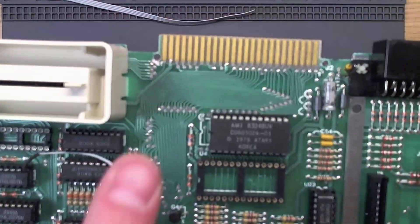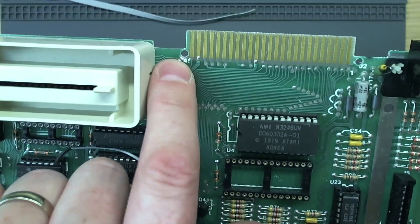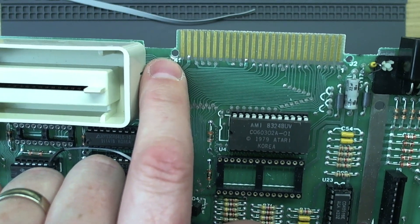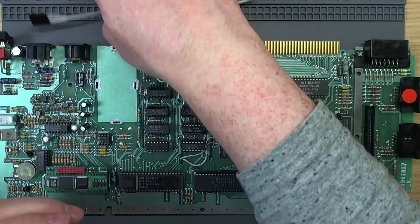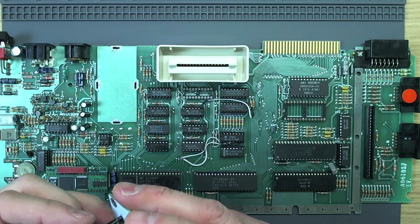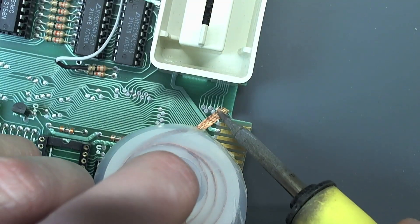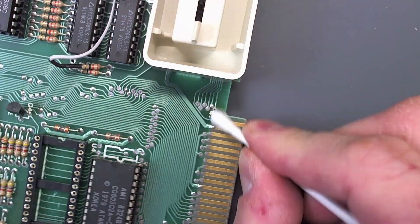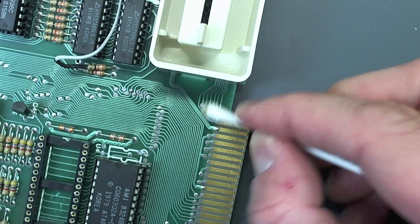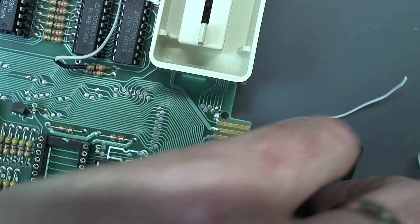I drilled two holes in the board here for the Ultimate — I got a little bit close to this via here, so I just had to scrape that away so that it doesn't touch the shaft of the screw when it goes in. I scraped that pad on either side of the hole, so that's going to fit very nicely. Now I'm going to rig up the wiring for the Ultimate. I'll see if I can whip the solder out of that hole. Let's clean away the flux and get that wire in the hole. I'm actually going to have to make a notch in the little pylon — it's a very tight squeeze but it all goes together beautifully.